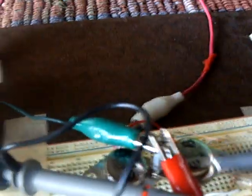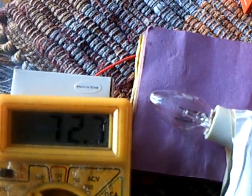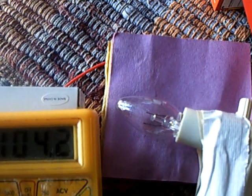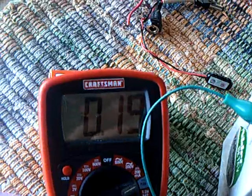All this is is a reed switch with a little neo magnet that's causing this to go into oscillation, and these transistors are helping. This is amazing — it's holding 43 volts on that cap with that nightlight on. Now if I turn this off, watch — it would just go right on up. Earlier in the day I had this at 150, 160 volts right away, and I was afraid I'd blow up the capacitor so I turned it off. Very impressive for an amp draw like that — 200 milliamps.